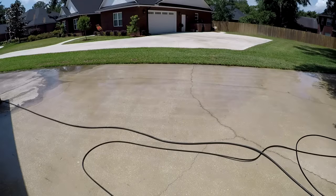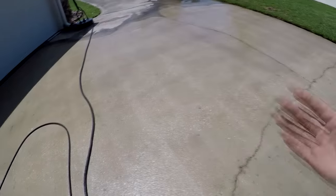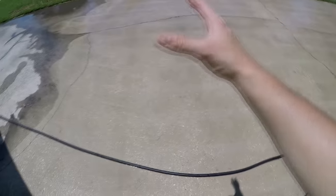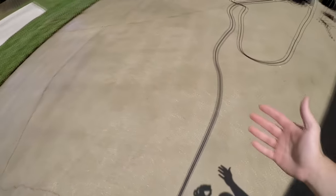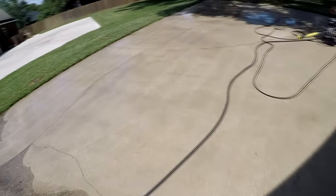So no surprise there — lots of streaks. Tons and tons. Maybe it's something where if there's too much dirt, the bleach can't actually get to the concrete and just sits on top. That's what this third test will hopefully show: if we do a quick surface clean and get the majority of the dirt off — yes there are streaks — but then apply the bleach, that's what the bleach is for, to break down those streaks. So we're going to come back, bleach all of this, let it sit for a bit, and then surface clean it again.